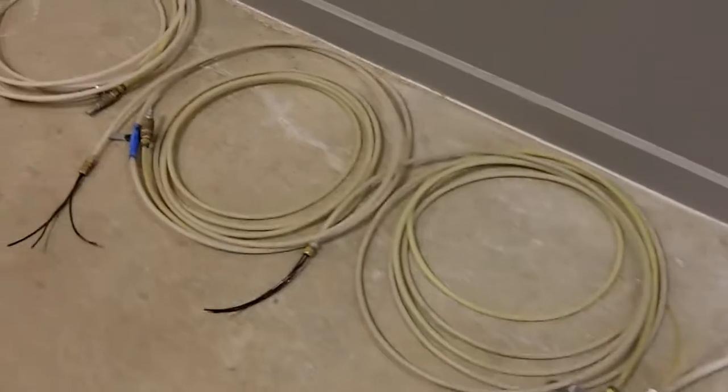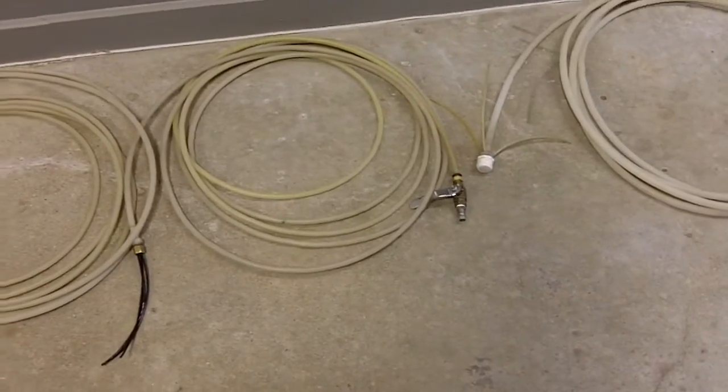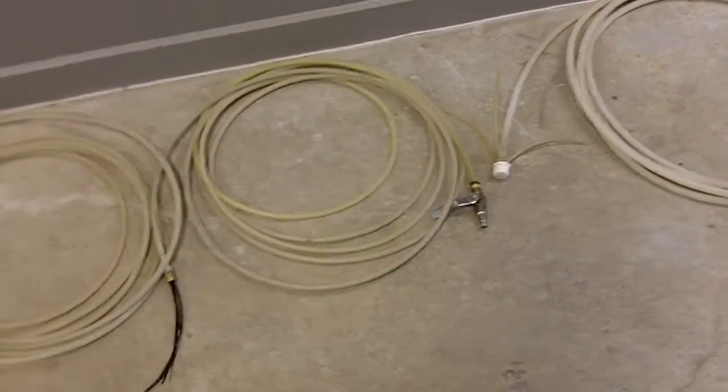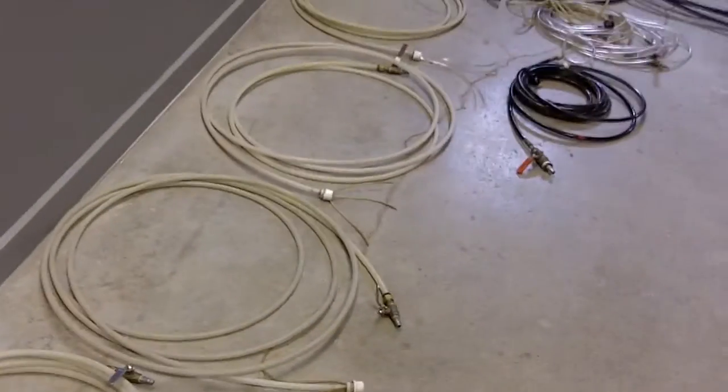These are our small whips. We have 3 of those here. These are probably the most used tool. It's used basically for pushing in, mostly residential. When you have the 6-inch supply lines, we'll push these down it. The larger whips are typically used for returns and trunk lines. And we have all the extra piping. I don't show it here, but lots of extra tubing for making these, and all the part numbers for things to make them. Just about all the parts are available at Grainger or McMaster-Carr, so it's not a big deal getting them.